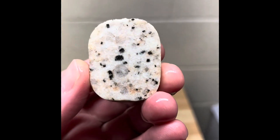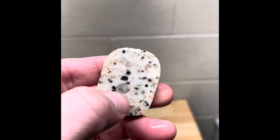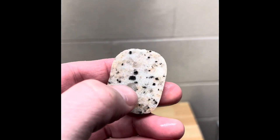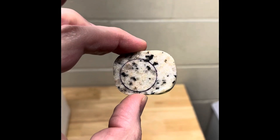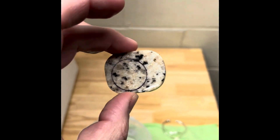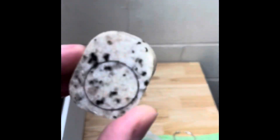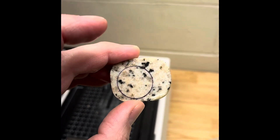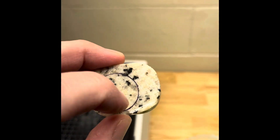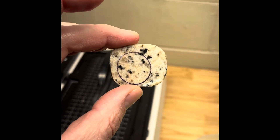This kind of chocolate chip looking one. Let me get it wet — the piece I wanted, I wanted to try to get this spot right here with this nice big clear spot. So I already traced on my circle. We're going to do a 25 millimeter and we're going to make it fit inside this bangle bracelet today. I'll get my six inch trim saw set up, get these edges cut off, then get the flat lap set up and get it shaved down to shape so it fits inside the bracelet, and I'll get back to you then.